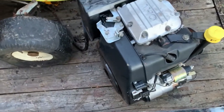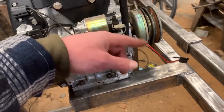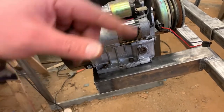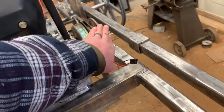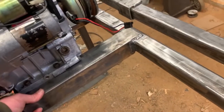It's so cold the water on the trailer is already freezing - I was slipping and sliding trying to pull this thing out. It's a little heavier than I expected but it's out now. I got it on there and wanted to make sure the bolts lined up and the pattern was right - it looks good. I had to put it in this direction because of the rotation - this is counterclockwise. I want my band to spin counterclockwise because from what I've read that's the direction the majority of them travel and you can have blade issues if it runs clockwise.